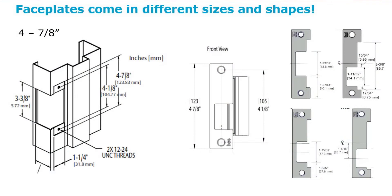Let's take a look at a metal frame. The metal frame often already has an existing pocket — a standard four and seven-eighths inch pocket that we're going to work with. We have to cut it open. We also have options for no-cut strikes, which we'll talk about later. But for the majority of work with frames, we're going to be doing some type of minor cutting.